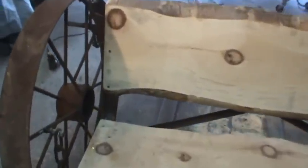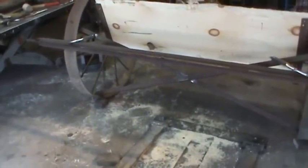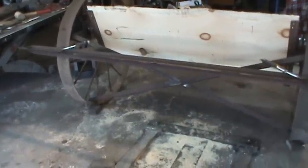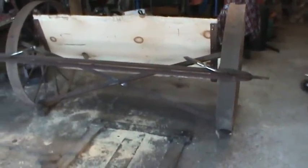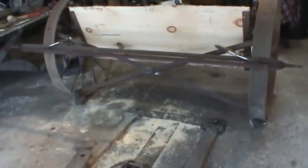I dragged it off the lift and got one of the braces put in. I had one clamped across the back, one clamped across the top, and leveled it the best I could. Then I took apart one of those staging cross braces and did the same thing a staging cross brace does—made a cross across the back of it. That'll keep it from racking side to side. I'm going to do probably two more, straight across.